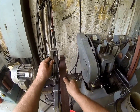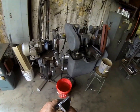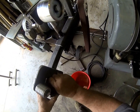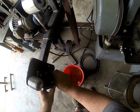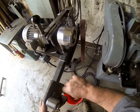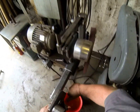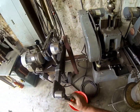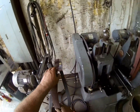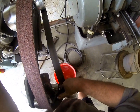If I want a flat surface, I take the belt off. I made this platen table — a little angle iron table with two three-eighths inch grade eight bolts to screw it in. Then I take a nine-sixteenths inch wrench and tighten them down. Now we've got a nice platen table.